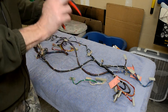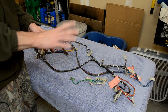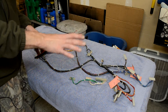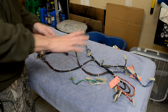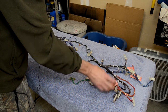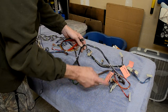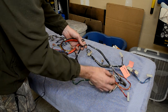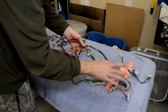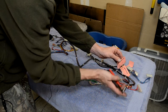Leaf switches, on the other hand, come out phenomenal in the dishwasher. Especially on older games, leaf switches are always tarnished and dirty — when they come out of the dishwasher they look brand new, with no downside as long as you dry them out properly. The only thing left on this harness is the factory paper tags — 'main display,' 'logic GI power harness,' 'main switch lamp.' I'll cut those off and save them, but obviously don't put paper tags through the dishwasher as they'll get destroyed.